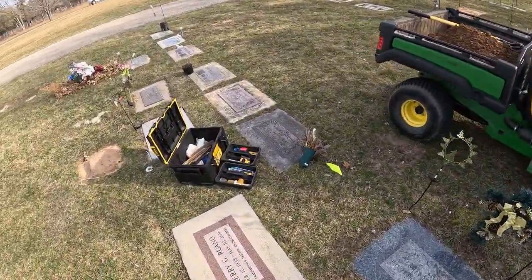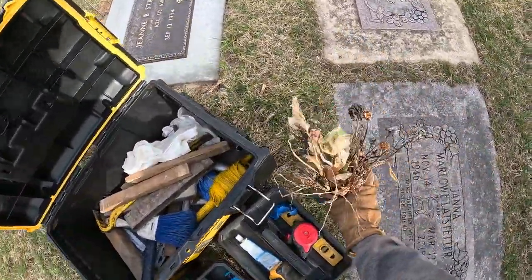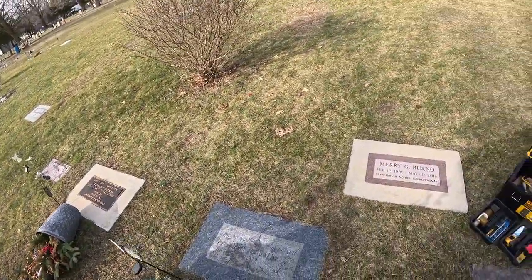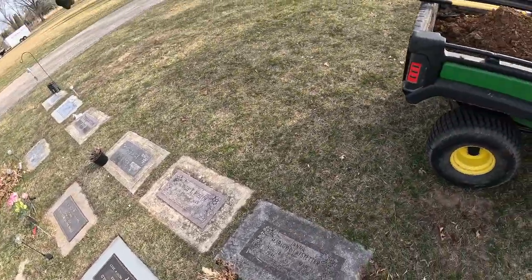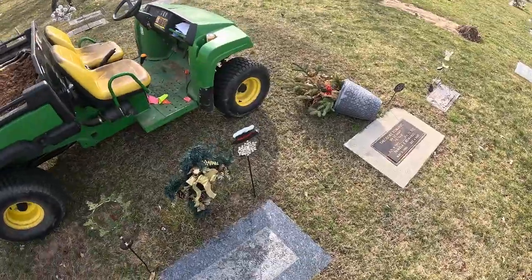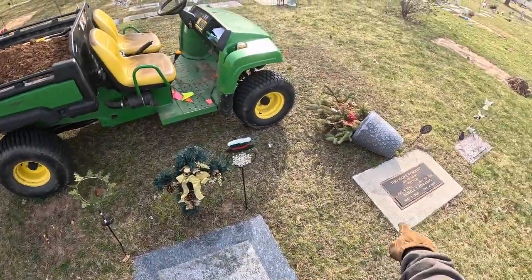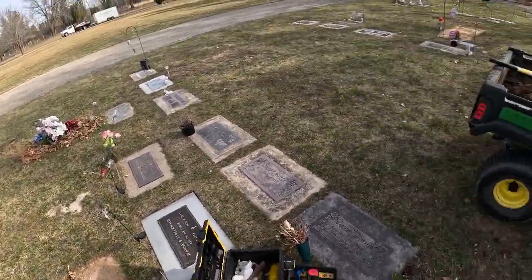What I do with these is I'll put a string line down from the interior 2x1. The inside of this larger piece of stone, the polished area in this case, is 24x12, and in this case the unpolished area is 24x12. So I'll put a string line down, that way my 24x12 will be right in line with the 24x12s there. I'll do that and get to working.